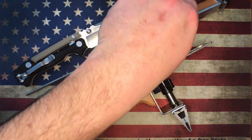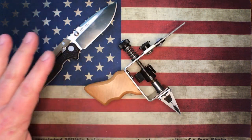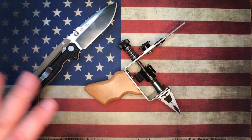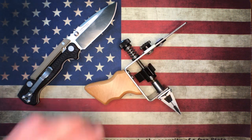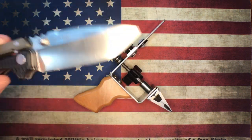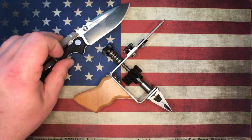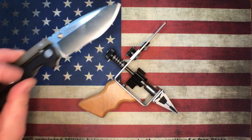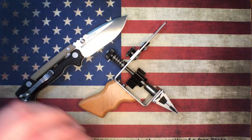So those are my complaints about the KME — it's not that it doesn't work, it's not that you can't get a better edge. I understand you can do all those things and mirror polish. I'm just talking about in its stock form with the deluxe kit — the part that costs $225 — what kind of an edge do you get for that kind of money? And this is it right here: no extras, just the stuff that came in the box. It's a good working edge, no question about it. It's very sharp, it shaves arm hair, and it tested at 165 on the sharpness tester — which is sharper than a razor blade or utility knife. That's fantastic.